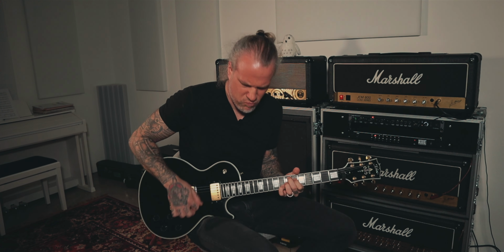Biased existing Svetlana Winged C EL34s to 36 milliamperes at 485 volts. Quite a high plate voltage for this style of amp, just for the information. So there was no need to change these because they were in good shape, and these are, I guess, pretty rare nowadays, the Winged Cs. And what else?